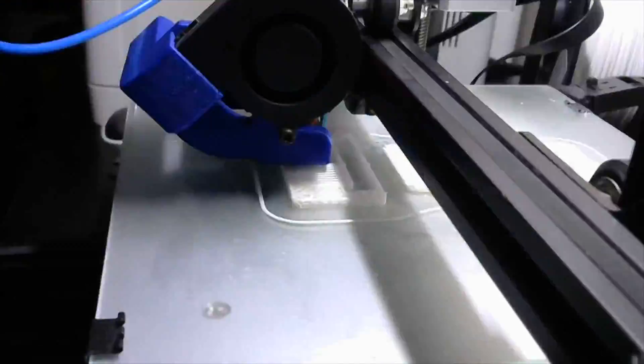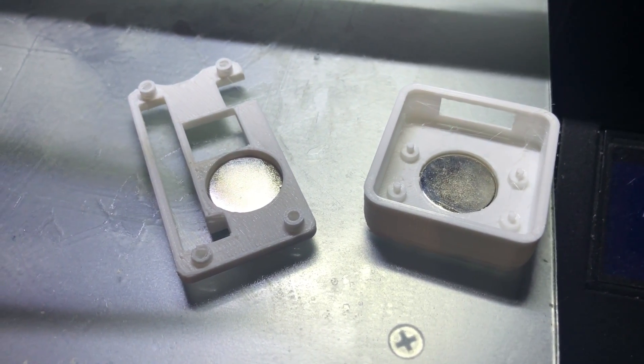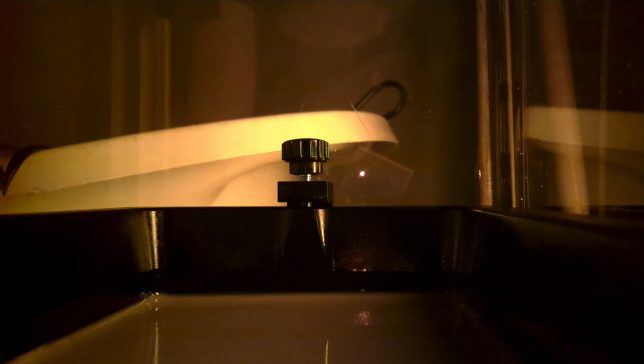Once you use this super glue, you can mount these magnets inside of the case. They will now allow each other to stick through the polycarbonate or acrylic case of your printer. So once everything is up and running, guys, you can sit in your hammock or your rocking chair or wherever you feel comfortable and keep an eye on your printer while it's printing. And once it's done, you go get your print. There you have it — how to mount a wireless camera to your SLA printer.